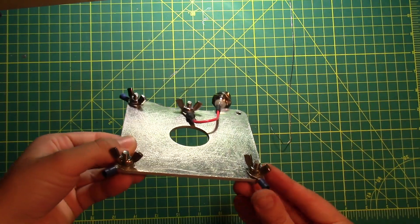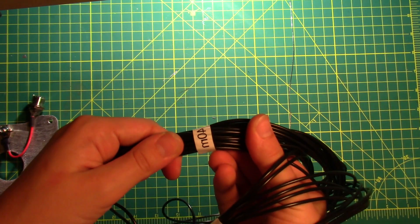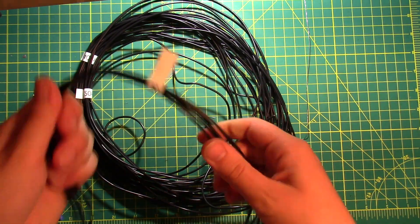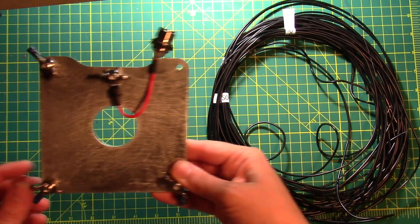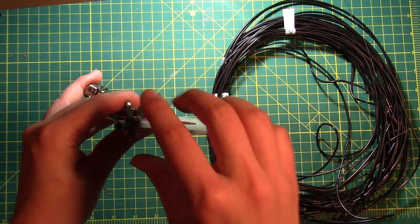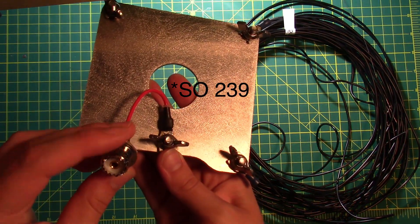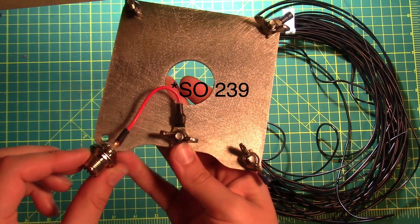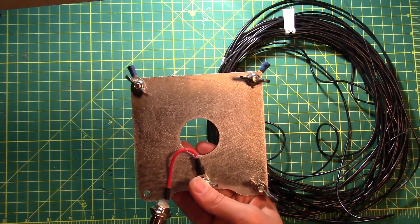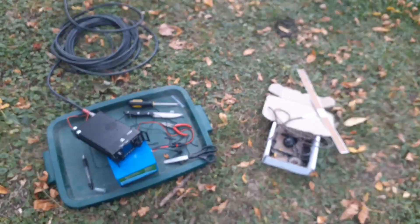The next step is doing the same thing with the upper bottom plate. You can see there are three — that's going to hold the 40 meter, 20 meter, and 15 meter elements. These use the blue fork connectors, so they're smaller. If you have the crimping tool, it has little color-coded dots: yellow, you crimp it there; if it's blue, you crimp it with the blue dot. And then I believe that is a PL-259 — I could be completely wrong, I always get them screwed up — but basically that's where your coax connects. It just gets screwed on just the same as everything else, with a little fork connector on the end.